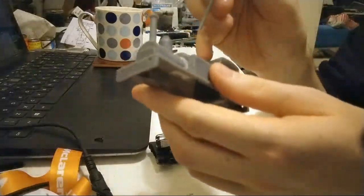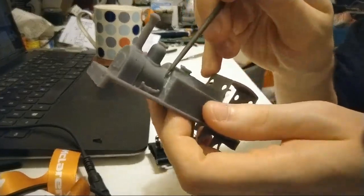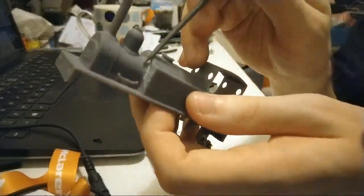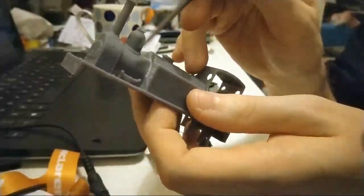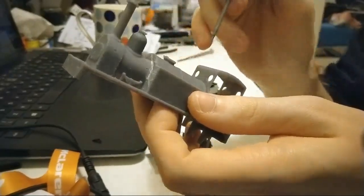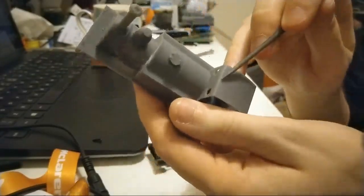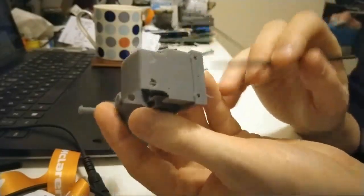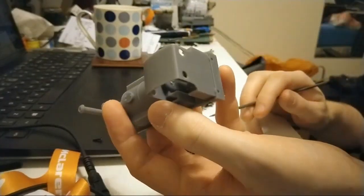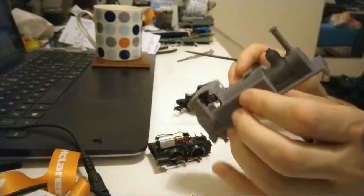And all my locomotives have things like these holes here. So we have holes sort of pre-drilled for handrails, a couple here for parts of the safety valve system, one up here for the whistle, a couple more for the handrails, some for buffers and coupling hooks and so on. Those are never perfectly sized, you always have to drill them out a little bit. They're a good guideline, so make sure you get everything in the right place.